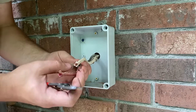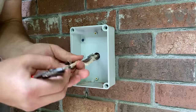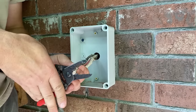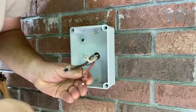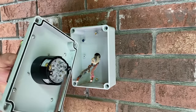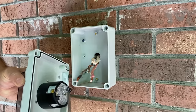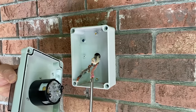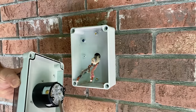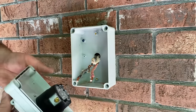It's best to try to cut these wires off the same length and then push the extra back into your hole. So I'm actually going to re-strip all of these and just cut them back to the length of this black one here. The wiring is pretty straightforward on this. The actual plug itself has screws on each side - there are just four terminals. It's 220 volts, so there's a ground terminal on one side and then the two opposing sides are for your hots. In this case it's wired as red and black, but sometimes they're yellow and green, and then white or your common is going to go here. Pretty simple - just stick the wires in and make sure that they're clamped down. I've got them all opened up right now; I'll put the wires in and tighten them up.